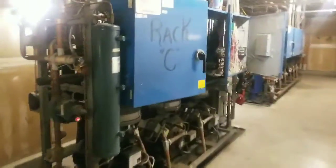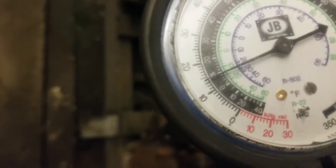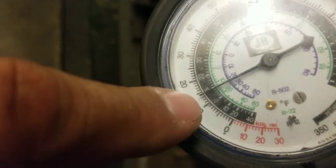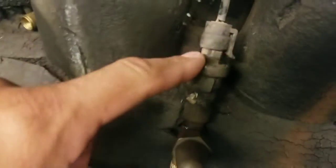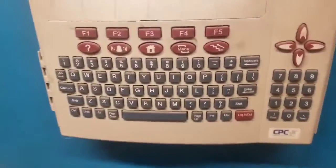So it's rack C — Charlie is right here and I already had it open, just going through stuff. My transducer is in the back. Right now I'm reading 14 psi and that's my transducer. It's an eclipse because of the clip. If it was a standard transducer it would be hardwired in — you wouldn't be able to detach the wire. That little clip is how you tell an eclipse transducer from a standard one.